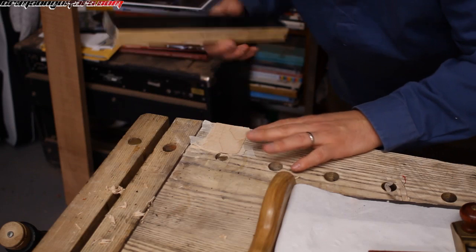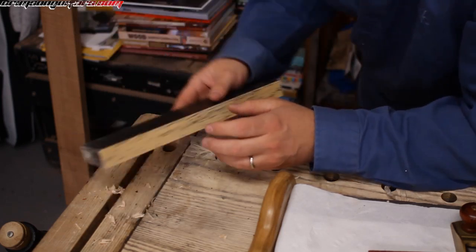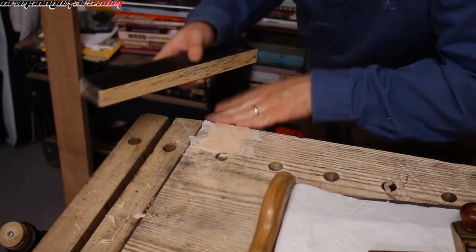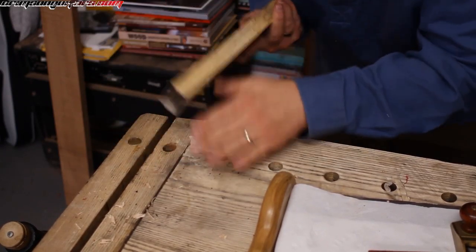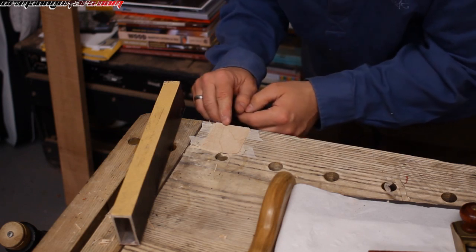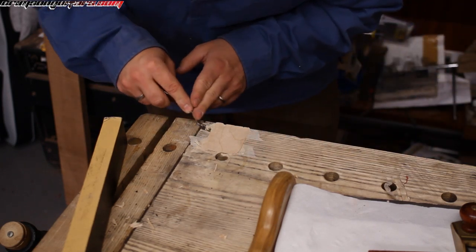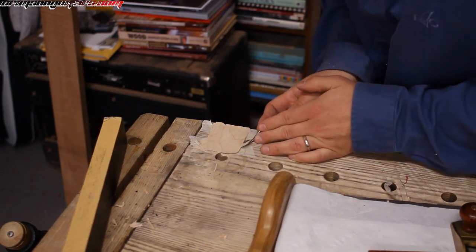Now this is the answer — we want to make it thinner. There are several ways to do this: you can go at it with a little plane, but with such a small piece of wood it's prone to chip out and less easy to control. You can go at it with a leveling file, but our leveling files are super fine. My preferred method is actually a leveling beam with some coarse sandpaper on it. The beauty of the masking tape trick is that I'm not trying to clamp this bit of wood to anything — it's just held down by the superglue and tape. Our leveling beams are leveled to very fine flatness on a granite surfacing plate.